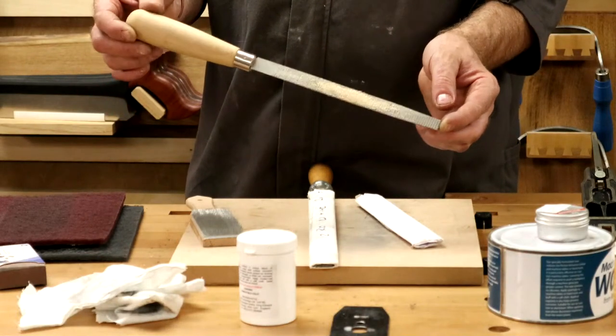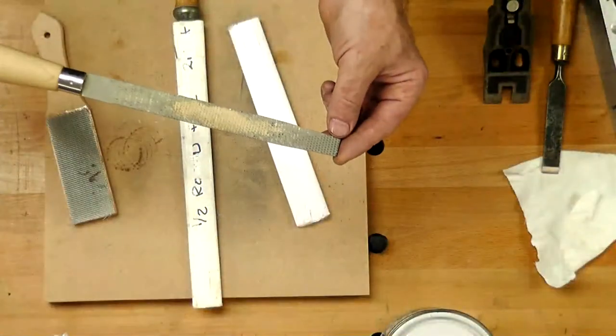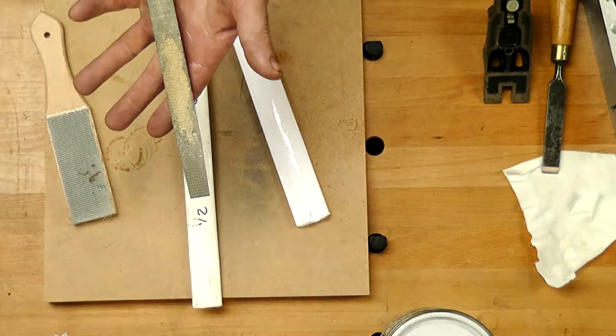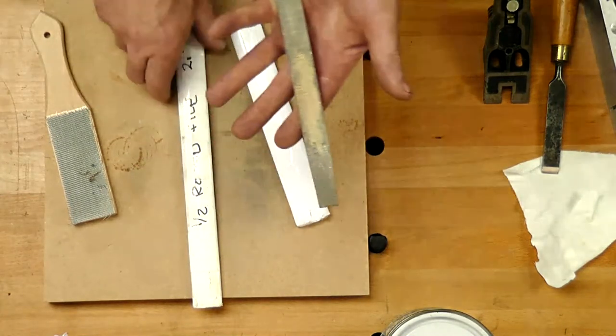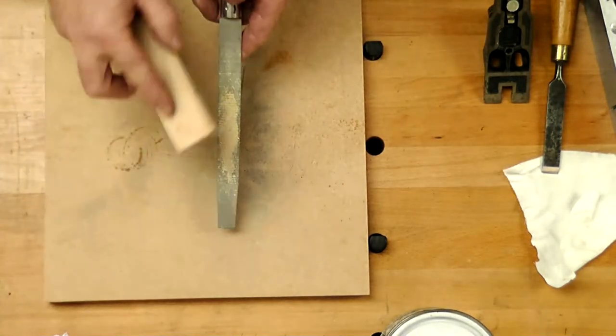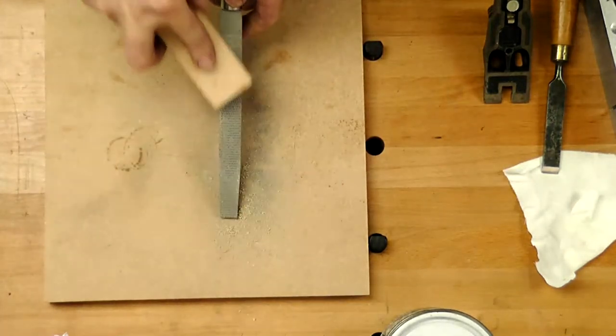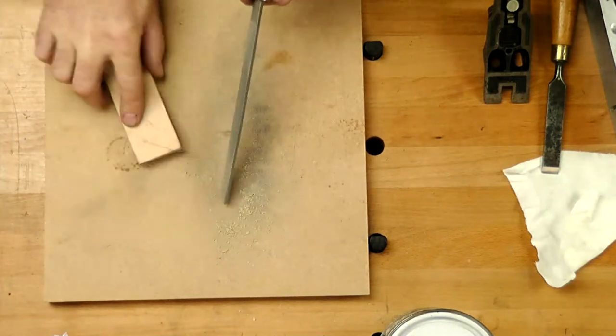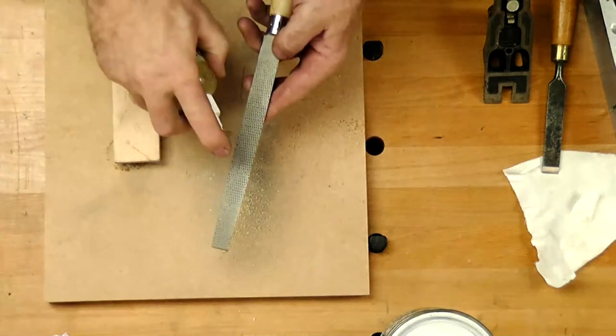So what's this? Craig, come here. Number three, look. Let's have a look up there. All this wood dust, look. Now, this will be a pine or something that's a bit resinous. It's stuck on there. So first thing we've got to do, your files, your rasps, you get a file card, which is a brush. Look at that, how easy. Brush it out.